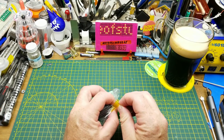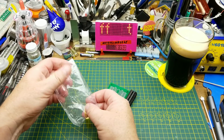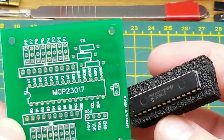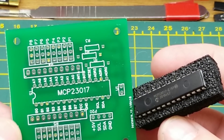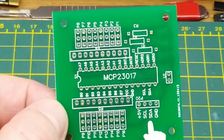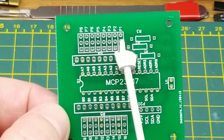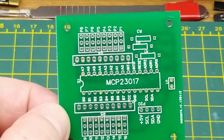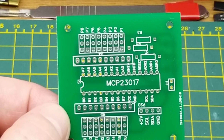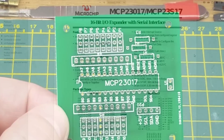This little kit, if you remember from the mailbag, is a GPIO extender board based on the MCP23017 chip. It takes I2C SCL and SDA from a microcontroller and breaks it out into 16 extra GPIO pins, which can be really handy if you're working with a small microcontroller or have exceeded the pin count on your board.